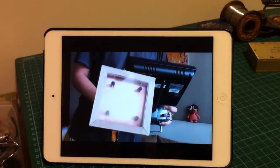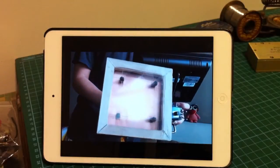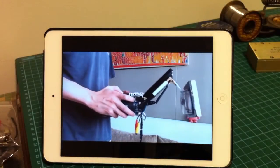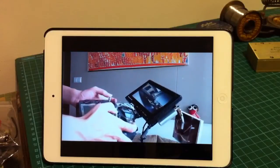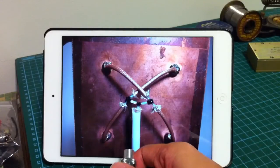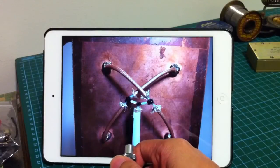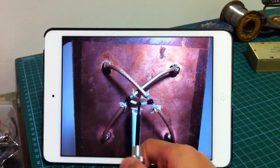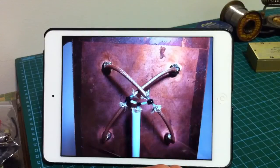This is how the Gat-Link antenna looks when mounted on my VRX. Unfortunately, it could not deliver the kind of range that I expected. The poor performance is most likely due to poor impedance matching, and that is caused by the incorrect lengths of wires used. This 50 ohms coaxial has to be exactly quarter-wavelength. But at microwave frequencies, it's extremely hard to get the lengths right unless we have a vector network analyzer. Luckily, I found a way of overcoming this challenge.